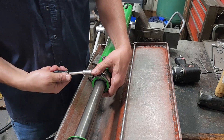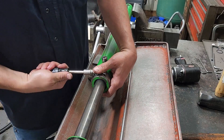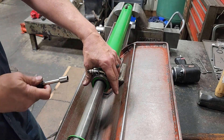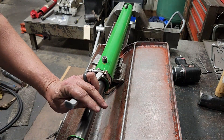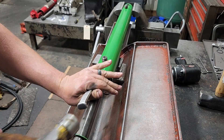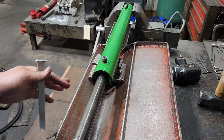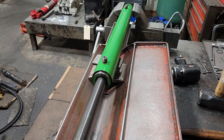I want this to where it's snug but not too tight — some resistance when you turn that head means we should be good. Take the aluminum punch and hammer that head back far enough that the ring is past the groove, then pull the rod back out. The gland just pulled out and stopped — it's locked in position.